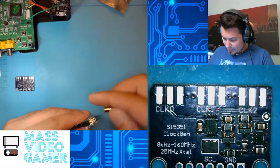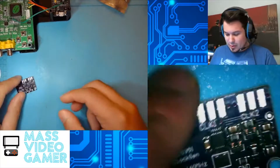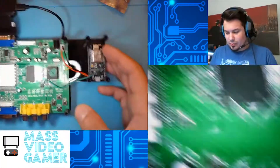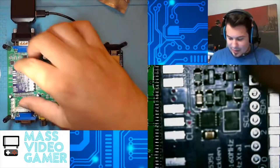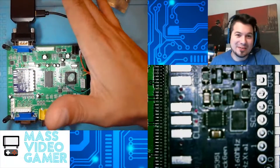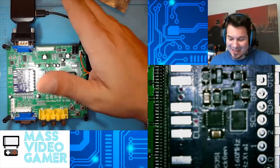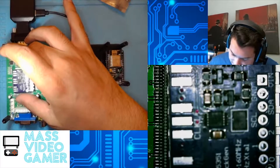This right here is the clock generator. All together there's going to be five wires we're going to solder to this board, and I'm going to show you right where we're going to mount it as well. It really does mount really nicely on this heatsink. I always recommend putting Kapton tape underneath to prevent any type of shorting, and maybe a little bit of mounting tape as well so it does not move around.